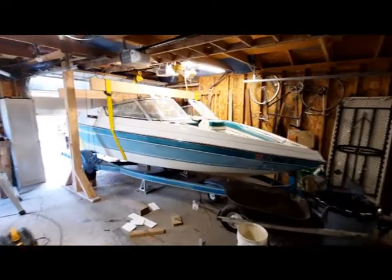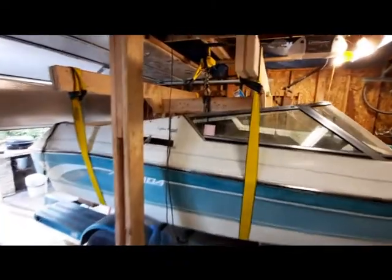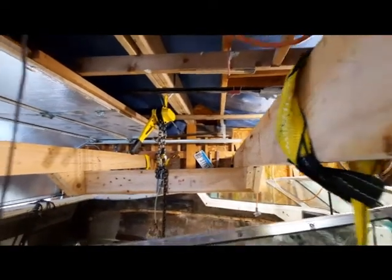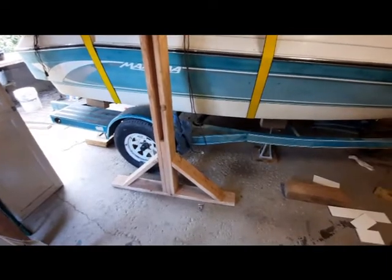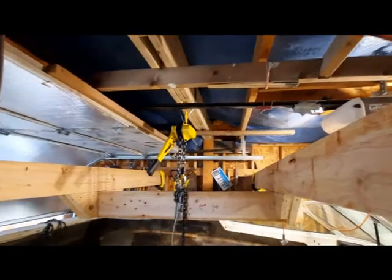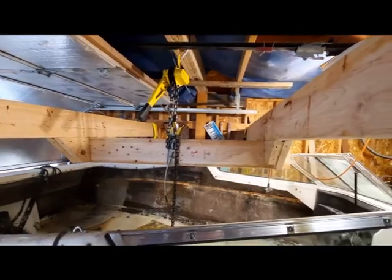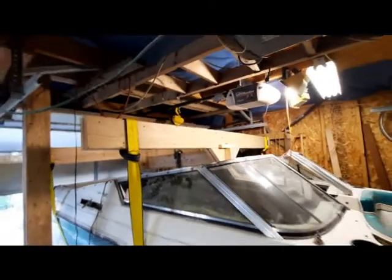What I did was early on in the project, I mounted a triple 2x10 in the overhead of my garage, supported it off of one wall with a 2x8 down to the ground. And then we've got this A-stand here out of triple 2x6s in compression. We have a Harbor Freight 1.5 ton hoist. That cross member there is a double 2x8 with plywood, and the other two cross members are also double 2x8s with plywood.